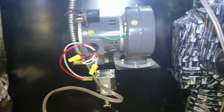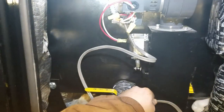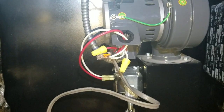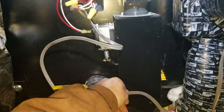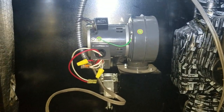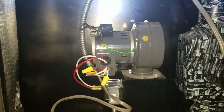As you can see, when I hook it up to an alternative power source, the damper and the motor still works. But the interesting thing is, when I tested the two cables, the one that goes up to the box had a hundred and twenty volts coming down to it, but the fan wasn't running. So now I'm gonna send this video off to the guy at Heat Masters and we'll see what he has to say, and we'll go from there.